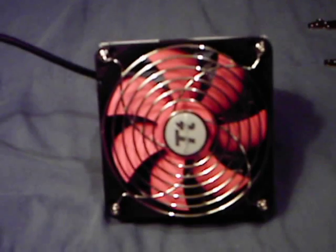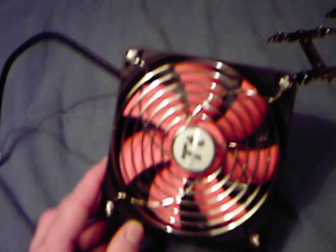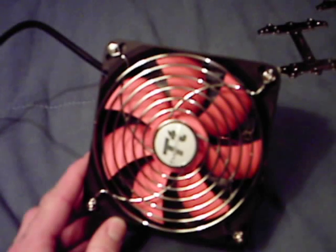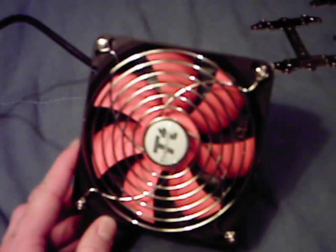The weight is 813 grams, which is surprisingly heavy given that it has six heat pipes. Compared to heat sinks like the Ultra 120 and Tuniq Tower, which are quite a bit larger, this has quite a bit of weight — I believe because of this fan. I compared this fan to an Antec Tri-Cool LED fan rated at 79 CFM in the same size, and it was only a couple grams less than this.